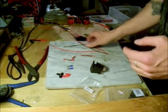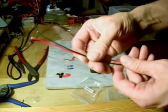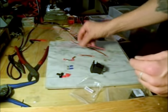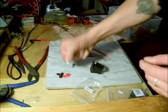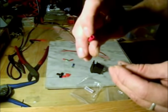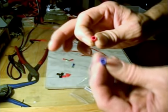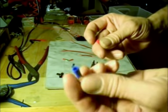You're going to need some wire. I've picked up some 16 gauge — this is red and black, it's a waterproof speaker wire, so it's good for outdoor applications. Nice and thick casing on it. You're going to need some spade connectors. I've pulled out two different types, two different sizes. The red is a smaller gauge than the blue. The red would be sufficient for most wiring applications, although there are a couple on these switches where you have to put two wires into a single spade connector, so the blue is better for that.